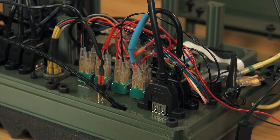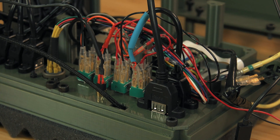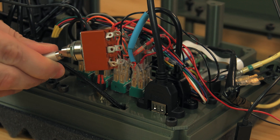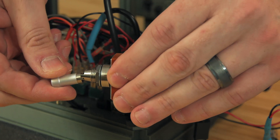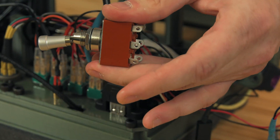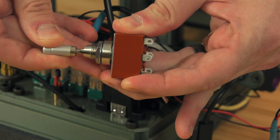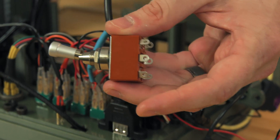I want to talk about the switches themselves for a moment, because it's important to understand exactly how they function and operate. Amazingly, there aren't a lot of great resources online for this. So I have a much larger version of these switches to talk through. The way these switches work — these are lock switches, which means you have to pull the plunger out to switch it. That does two things: it prevents accidentally knocking the switch on or off, and it ensures that when the switch happens it's quick — an instantaneous switch. This type of switch is called an ON/NONE/ON switch.